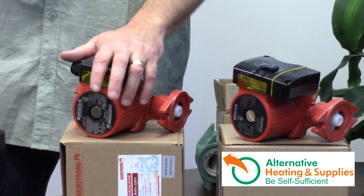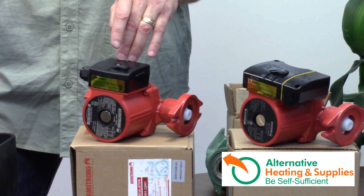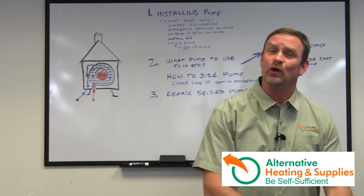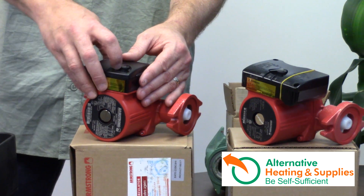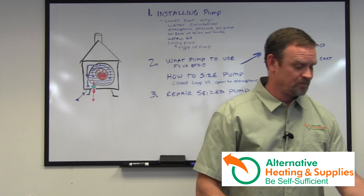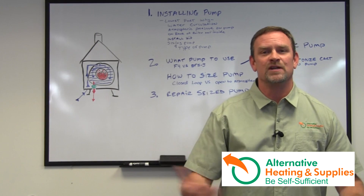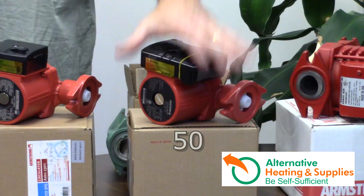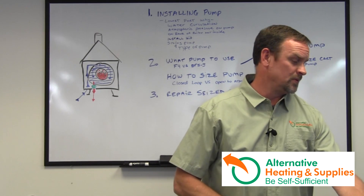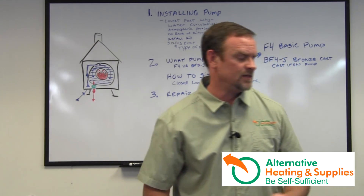To be honest, the Taco 7 and the Armstrong 30 pump the same amount of water volume when the Armstrong is on high. The speeds on the highest setting are what the pump's maxed out at, so you're losing water circulation on lower speeds. But it's a nice feature if you're using radiant or any other application where you want to slow down the water flow. Your Armstrong 50 is up to 50 to 100 feet — great little pump, great on efficiency. The Armstrongs are actually a little bit better than the Tacos on efficiency.